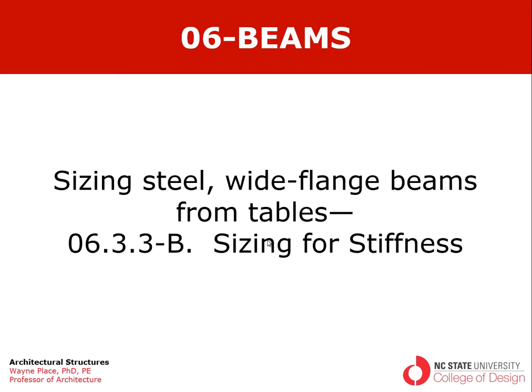We will make a distinction between stiffness and moment strength. Moment strength is absolutely crucial, and we will size beams under full factored load for moment strength, but stiffness is also absolutely a crucial design criterion. We size for stiffness first because in this iterative process of sizing, it allows us to go directly to a single answer that satisfies this criterion, which then becomes input to the next stage in the computation.